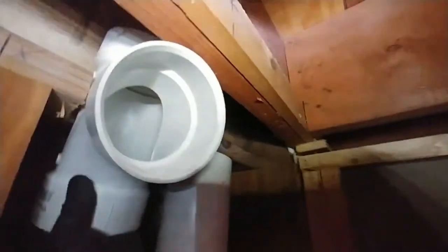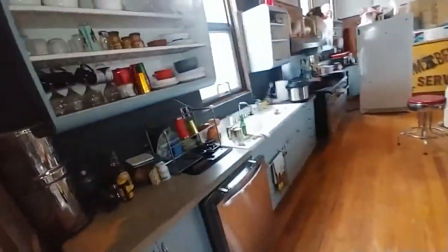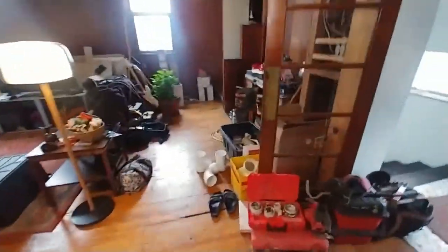So we'll just take a chunk off the end of this fitting, enough to go sliding up, come straight forward through the hole enough to make the corner, put the stack into it at that point, and then we'll be upstairs once we have the toilet and shower connected down here, and then we can finish up getting the sinks in. Now, as far as the rest of the space here, we've got a pretty cool idea